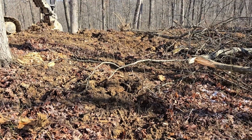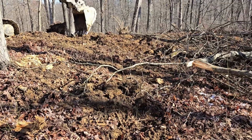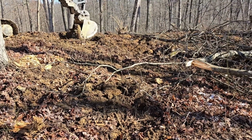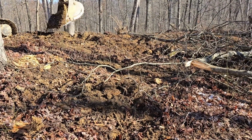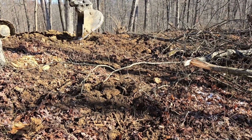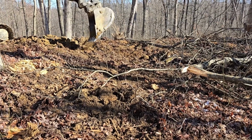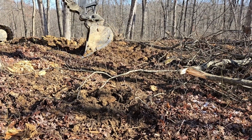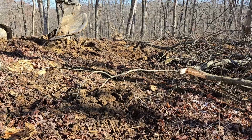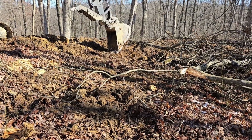The access road leading to the new wetland is being decommissioned by filling in gullies, using the rough and loosen technique, by adding pit and mound topography, and finally by placing many large trees that make OHV traffic impossible. We built a total of 16 vernal pond wetlands within the access road as part of the restoration program, and this was done to control erosion and to improve habitat for a diversity of wildlife species.